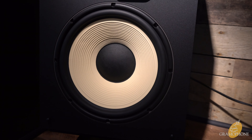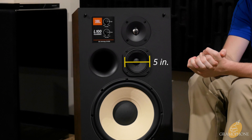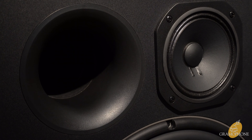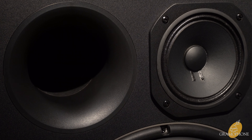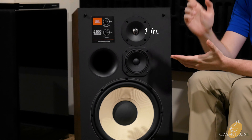The speaker plays from 40 to 40,000 Hz, and the woofer crosses over at 450 Hz into the midrange. The midrange on this speaker is a 5-inch pulp driver, and this driver has a nice laid-back but not undetailed, pleasant and warm sound to it. It crosses over at 3,500 Hz into the 1-inch titanium dome tweeter.